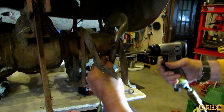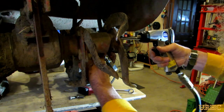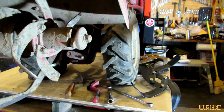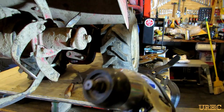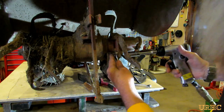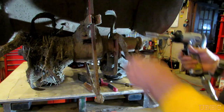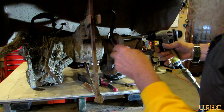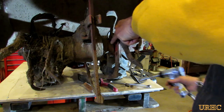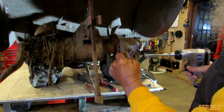All you have to do is loosen up — actually, you only have to take out one bolt on the set of tines, then loosen up three other bolts and they come right off. Here I'm just using a little impact gun to remove the first set — that's one of the Harbor Freight three-eighths drive impact guns I bought probably 15 years ago. It's a handy little item that's worked flawlessly. You take the outer set off, then do the same thing on the inner set. They're not really bolted to the tiller at all — they're just wrapped around the cast iron housings.